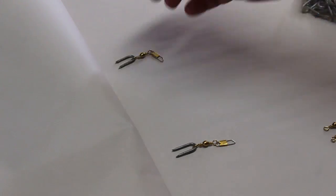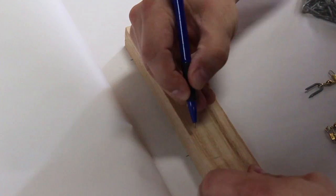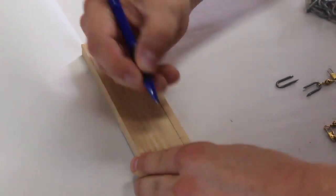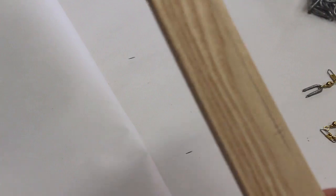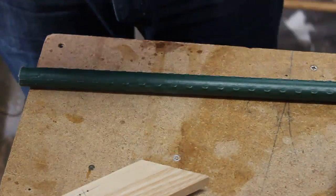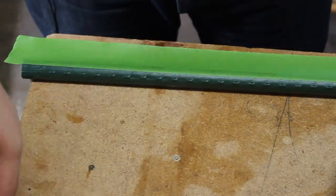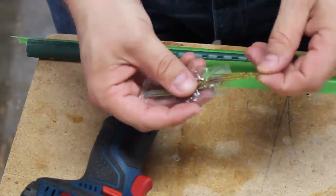The trick is taking the staples and putting them inside the little swivel, so the staples are our center point — it doesn't have to be perfect. Then we're going to use a story stick, which is what woodworkers use to ensure uniform distance between objects. On a piece of oak, I've marked where the centers are, took a staple and hit it in, then went to the drill press to drill it out. Next, we secure the pole with a bit of tape so it doesn't move, then use the story stick to drill the holes uniformly — nice and even.